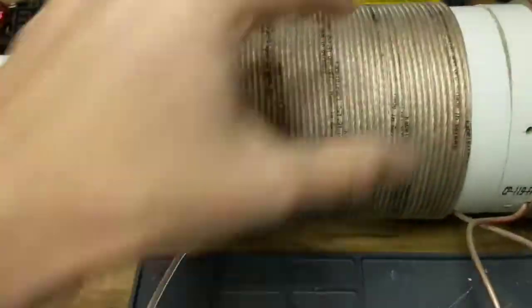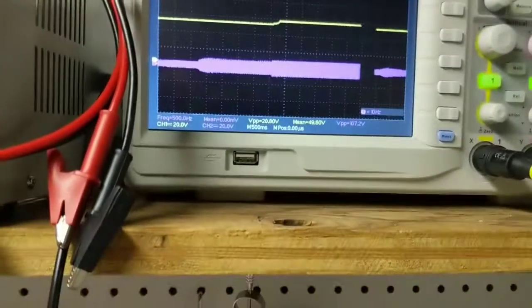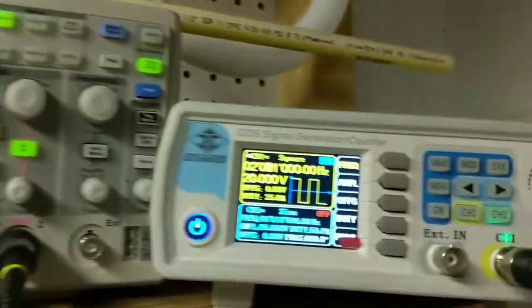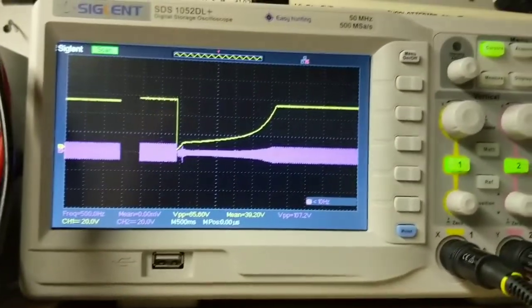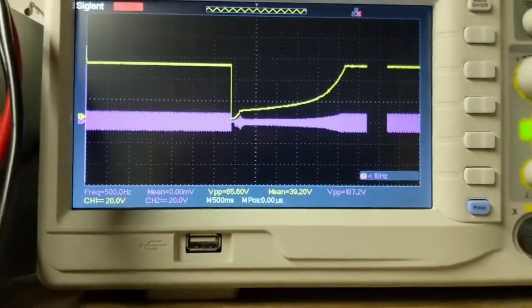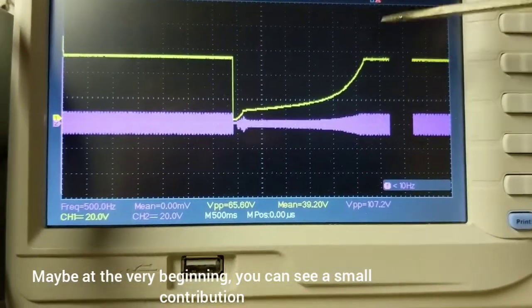Now if I move my L1 nearly completely inside L2A, then we get a slightly different response. I still have my oscilloscope measuring L2B, but let's see what happens on the capacitor. I've had to reduce the frequency to get L2A to respond a little better. It's still a trumpet wave on L2A, and what's interesting is there's a huge voltage between these coils. L2B is not contributing to the capacitor voltage in any way.